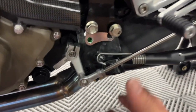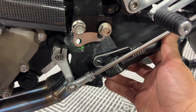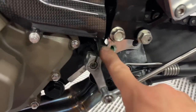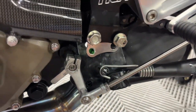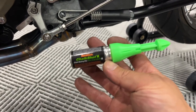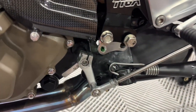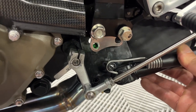As for the kickstand bracket, I'm going to drill a new hole — something like this position gives maximum clearance. The original hole was about there. Anytime you have a recessed hole, it's hard to mark it because your pen can't fit in. I suggest using a pressurized paint marker — you put it in the recessed hole, push it, and it shoots a little dot of paint so you have your marking.